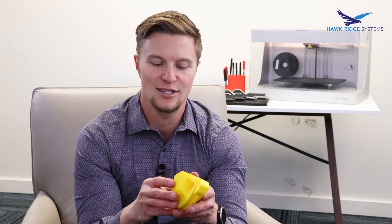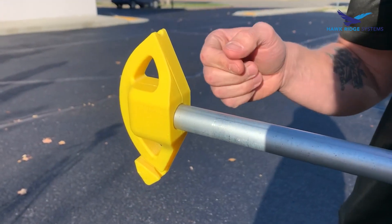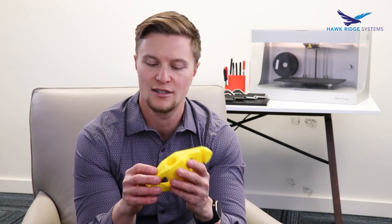Let's go ahead and break down what just happened. As you saw, we had a ton of fun with our 3D printed pipe benders — a super awesome idea for a tool that anybody running conduit or anything like that is going to need. The examples we came up with worked pretty well with quarter inch tubing, so that's where we started. Starting with our ABS part, as I mentioned previously, this thing was kind of doomed to begin with — the clearance was a little too tight for our application with the handle we were going to attach.